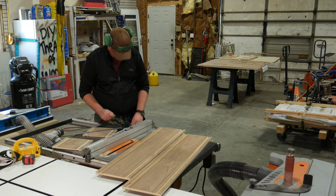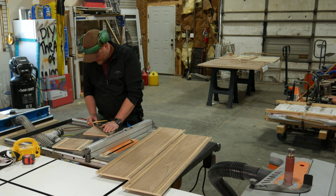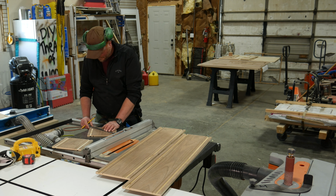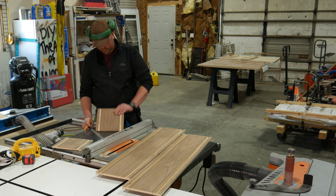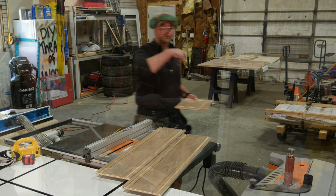Easiest way to find the center of something that's square or rectangle like this is just draw a line from corner to corner, and from the other corner to the other corner, just a little X in the middle. X marks the spot right in the middle. So follow me over to the drill press and we'll drill these holes.